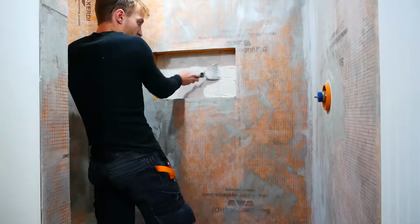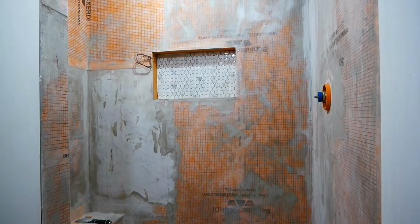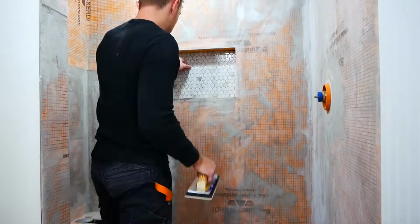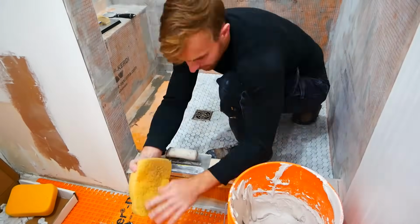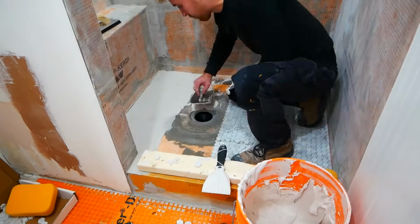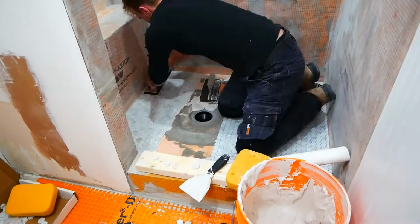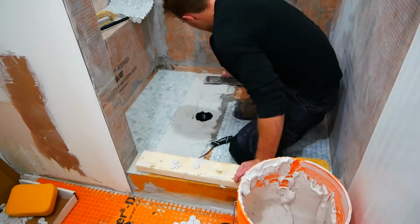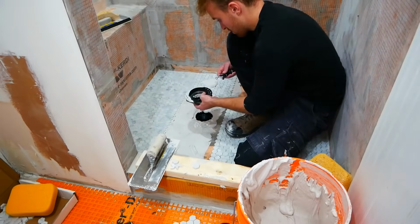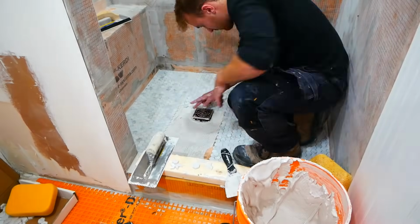It was finally time to start tiling. I first decided to do my backsplash for the niche and the floor. For this, I'd be using the same mosaic sheets, and it went okay. I made a mistake in which I didn't use tile spacers between my sheets, so now that the floor is finished, if I look closely, I can actually see where the sheets were. You might not notice it if you weren't looking for it, but since I did it, I fear that I'm always going to see it.